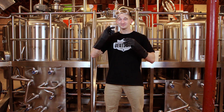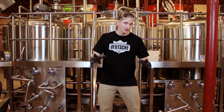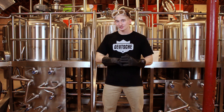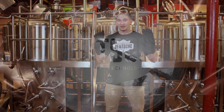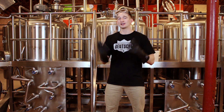Another thing is the actual mechanical forces — the actual pressure and forces that you're hitting all your surfaces with. This is the most overlooked part of CIP. You want to make sure that you've got your CIP balls and your pump blasting all your sides. You want to hit every single surface of the internal walls of your vessels, your rakes, your calandria, anything in there. That's why we've got spinning CIP balls — they rotate to hit all the surfaces.